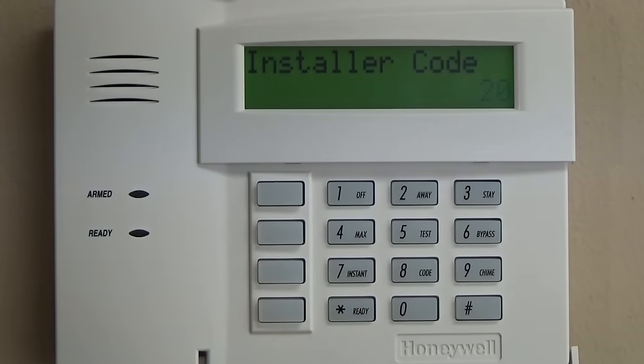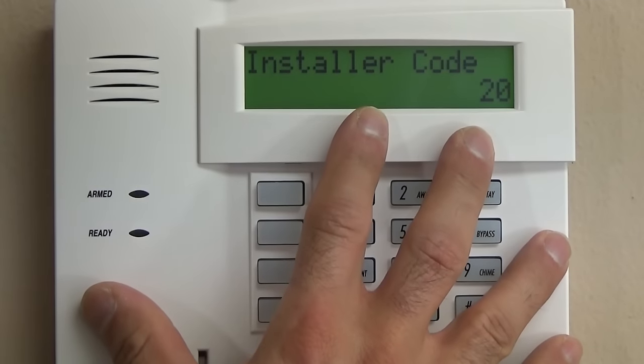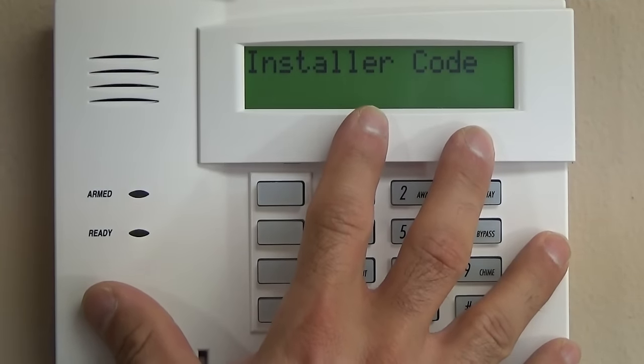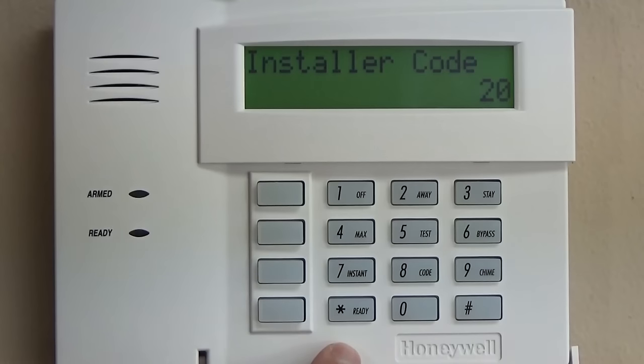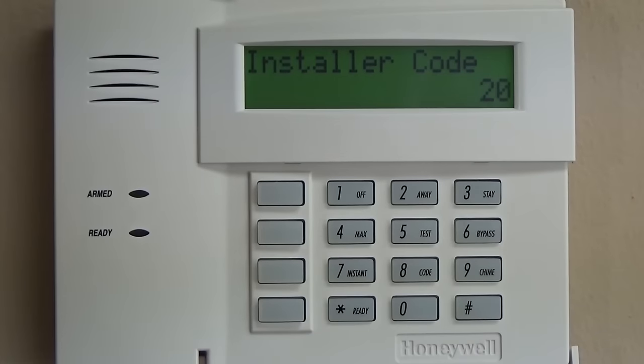One thing that's important to mention is your system needs at least one way to talk wirelessly to your contacts. That's usually going to be through a 6160 RF keypad, which is hardwired from the keypad to the Vista 20, and then wireless from here to the wireless contacts, or you can use what's called a 5881, typically the ENH, which will allow you more wireless zones.